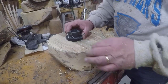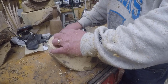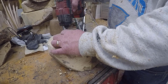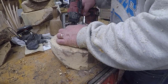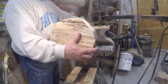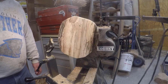So far I've got about a minute, minute and a half onto each one — maybe less — and I want to keep it down as much as possible. I don't have to nitpick that much. I want to keep these down to about 15 minutes per bowl tops, and the idea is to get the rough shape and move on to the next one. I'm going to mount my face plate and mount it to the lathe and show you this one in real time before I move on to the rest. Sweet gum is fairly soft and it goes very fast. When I finish all these I'm going to have a mountain of chips to deal with.